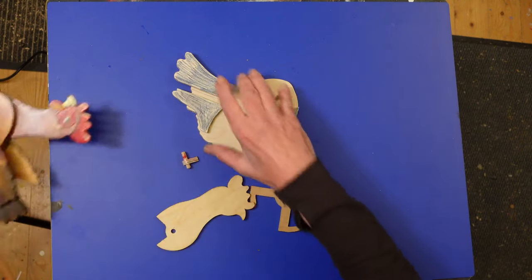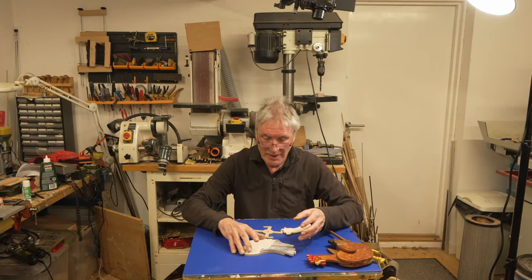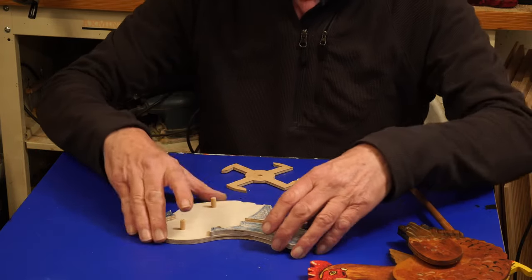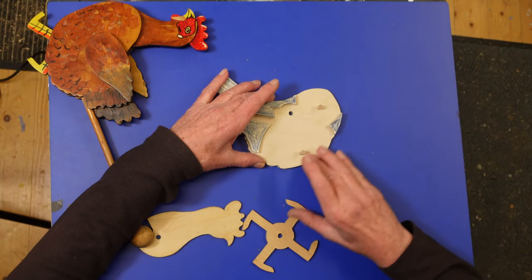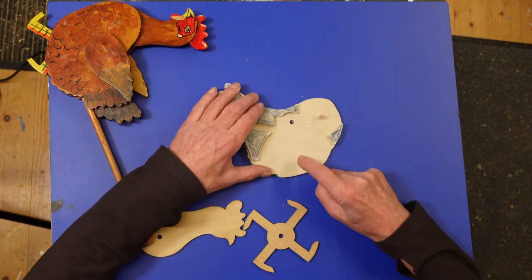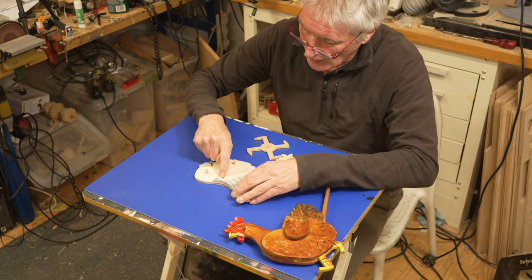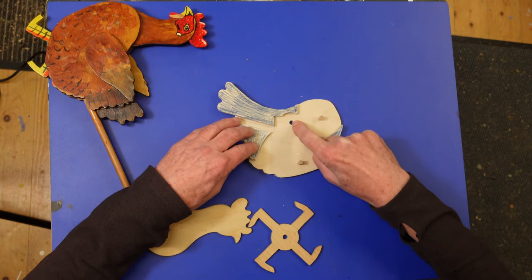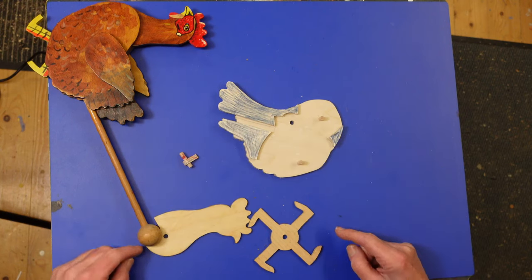Once you've cut out the parts, I'll show you how they go together and the rough principle of it. First of all, cut out each side of the body and clamp them together before you drill them. Then you need two holes which are exactly the same size as the dowel — a tight fit — and one hole that's a little bit bigger. This is 6mm, so I've got two 6mm holes and a 6.5mm — basically just a little bit bigger than a quarter of an inch.